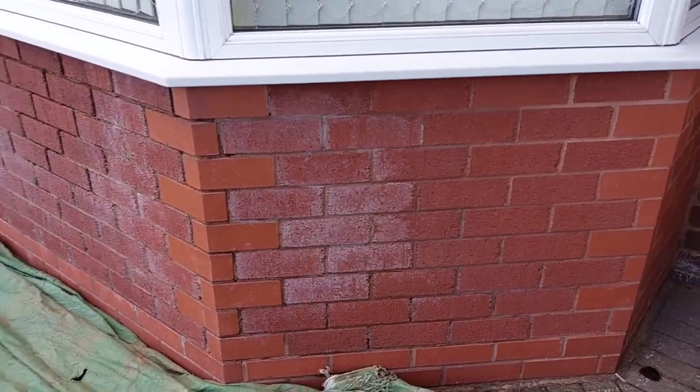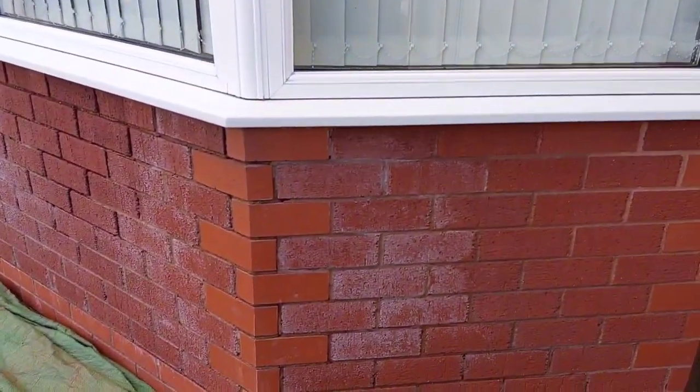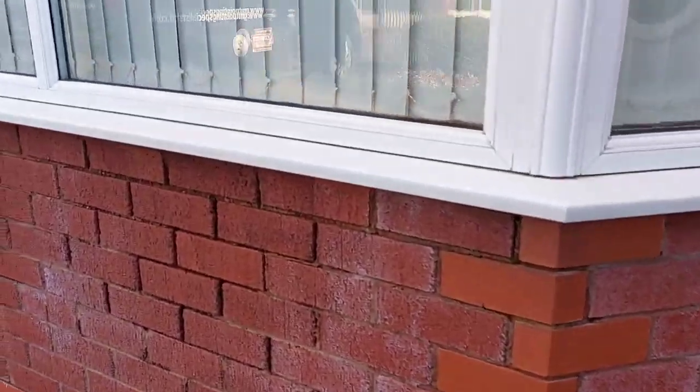Little job for me. Problem with the efflorescence, and it's actually windswept, deteriorated. Could be either the wind or it was just a bad mix, and they've pointed it in the full sun.